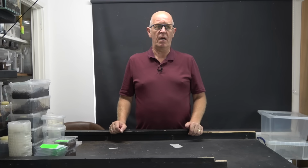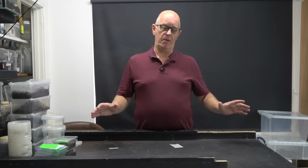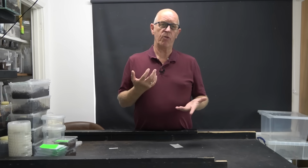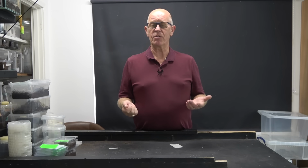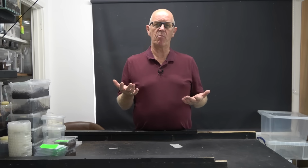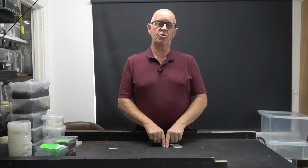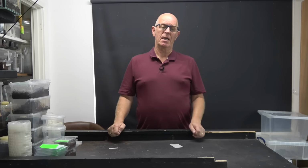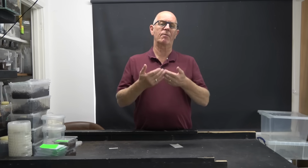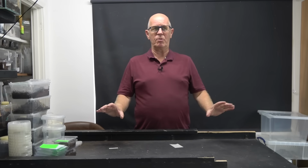What else did we do? You also saw there as well that we blackjacked all of the bases again, and that is so that moisture won't rise up through the timber and rot the timber out over time. Although all the timber is tannalized, apart from the boards, they have a very, very low content, so they're more glue, to be fair, because they're like a man-made board. But all of your timbers, the 2x2s, the 2x4s and 6s, they are all tannalized. But that being said, we still give it extra protection by painting it all in the blackjack, and that stops moisture rising up through the timber and rotting it out. So it gives it a greater lifespan. So that is what that is all about.